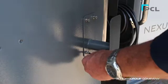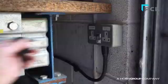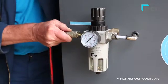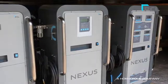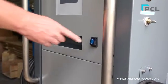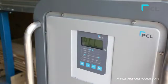To commence startup, connect the power supply cord to the IEC socket on the back of the unit and then plug into the normal power supply socket. The air supply must be connected to the air inlet on the side of the filtration unit using your existing air hose. Please note that your compressor supply must be a minimum of 8 bar for the NEX2 units and 10 bar for the NEX6 and membrane units. Now turn the machine on by switching the blue button on the front to the ON position. The LCD will light up and the unit will run its normal start-up checks. Wait until the unit display reads the default pressure.